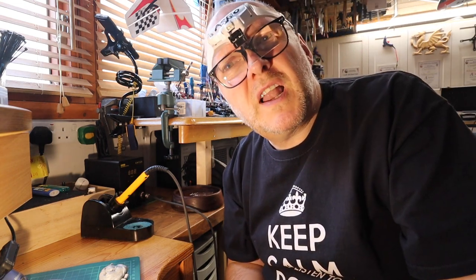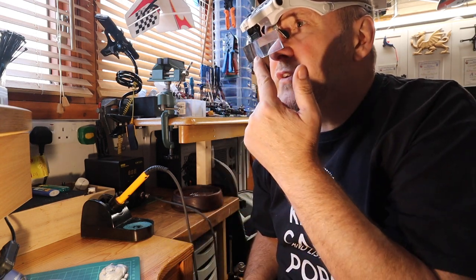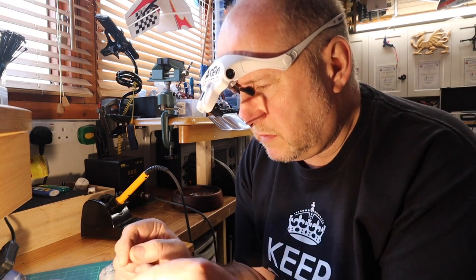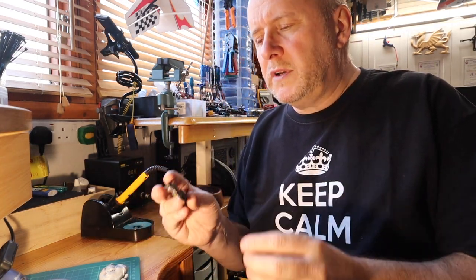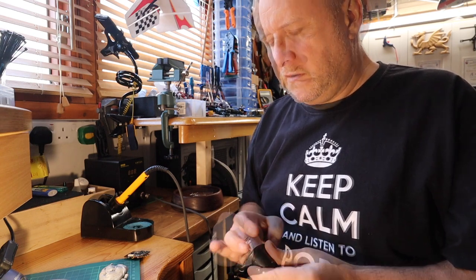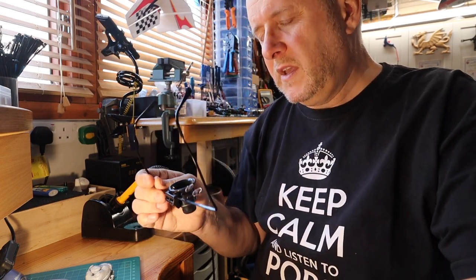If your eyes are struggling like mine, I found these magnifying glasses — you can wear them with your regular glasses or without, and you can adjust the focus. I had different strength ones but found these ideal. When soldering you want to be at about this distance and these are focused there. Also a jeweler's loupe is useful — you'd be amazed what you can see up close: bridged solder joints, splashed solder. Absolutely fabulous for doing soldering work.